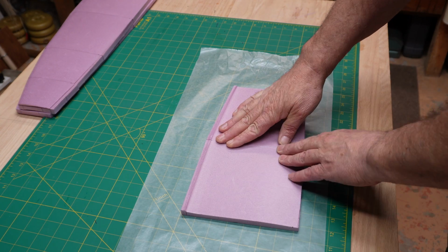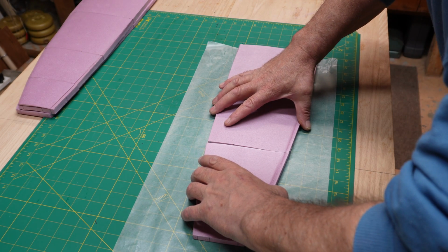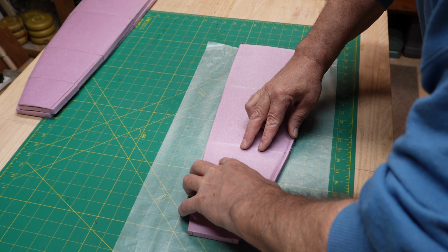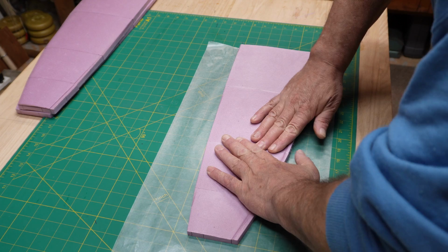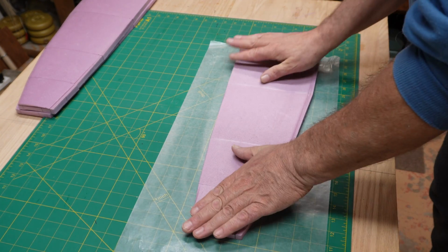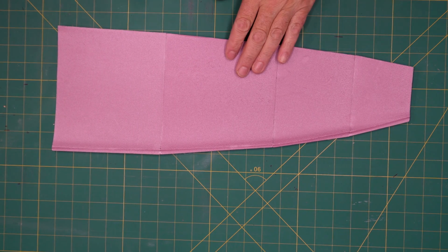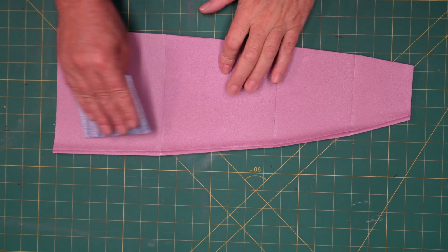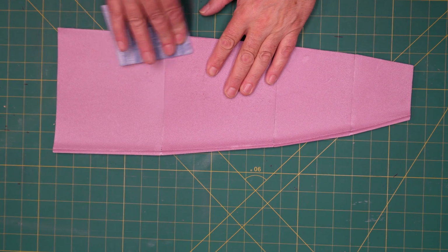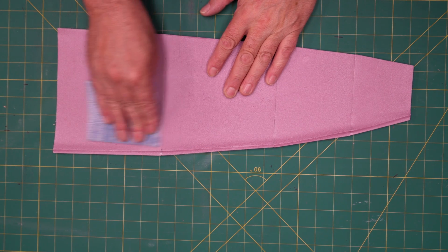I like to make my beds first. Just glue them up together, align all the marks. And this is going to help us in alignment a little bit later on. And just push everything together. Now that our beds are glued up, we can hit it with some 220 sandpaper. We're just going to take off any high sides that are on the bottom here where the sections are joined. Okay, it's going to help with alignment as well.